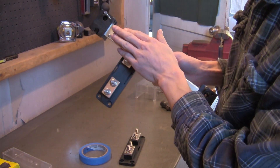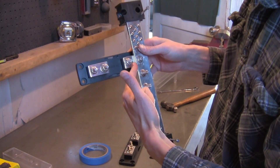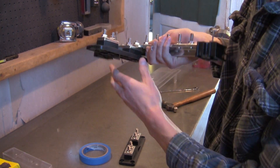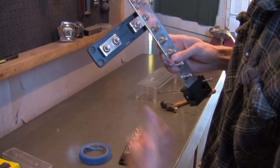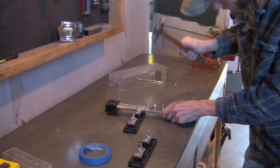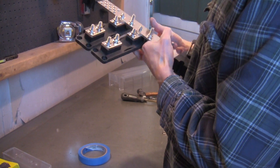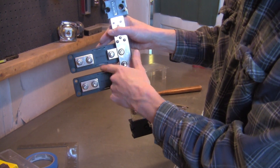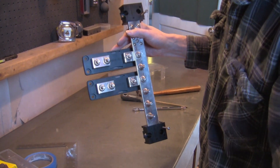This is the positive bus bar, and this is going to be one of the large ANL fuses. To save a little bit of cabling, I just popped the stud out and bolted it straight bus bar to bus bar - it's a connection and we're done. You don't even need a cable. Just shove this right in there - oh my gosh, like it was meant to be. This is going to be an inlet fuse - the main - all live with 12-volt positive power, and this outputs to the inverter.